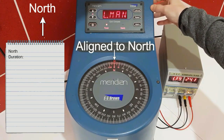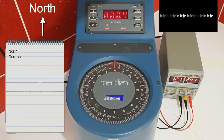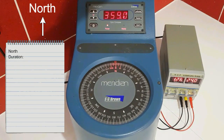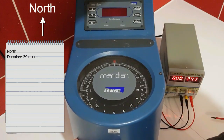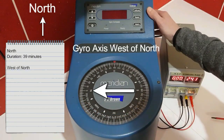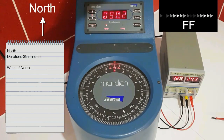I'm now going to show three hours of north-seeking tests sped up to approximately three minutes to show the movement more clearly. It's worth noting that the gyro compass works in two steps: north seeking and north keeping. North seeking is the first step, demonstrated here, during which the unit must be as stationary as possible to seek true north - it takes between 24 and 90 minutes. Upon finding true north, the green ready light comes on and it changes to north keeping mode, after which it can be moved around and used for navigation. I tested its north seeking function with the gyro axis initially aligned to all four cardinal directions.